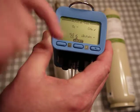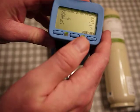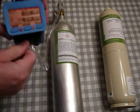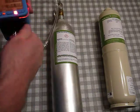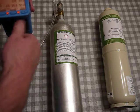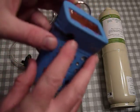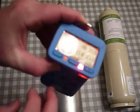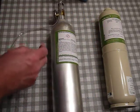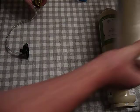Those are done now. If I take this off or turn the gas off, it's going to go into alarm because it waits a couple minutes then starts detecting again. It's going into alarm — you can put your finger over the little hole here to dampen the sound while calibrating. It comes back down pretty quickly.